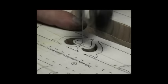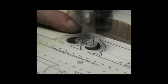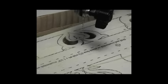With the hole position selected during the drilling stage, we can smoothly cut straight into the line and begin the curve to the V for the center heart. When the V takes off into a straight line, I'll sometimes go just a tad further to ensure the blade will be able to take off in the new direction.